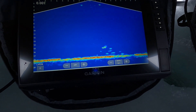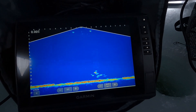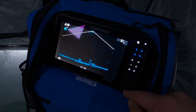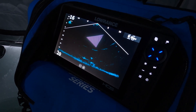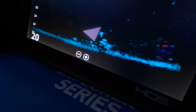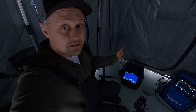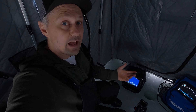You can still mark my lure and still see fish around it. Let's go over to the Lowrance now. On the Lowrance we don't have a gain setting — we have a contrast setting. Lowering that, we can still mark the lure and still see fish, but there are just a lot of trails behind those fish. It's not as sharp an image. I could play with the angle a bit. These two units — the Garmin and the Lowrance — are in my opinion the two best live sonars you can get today: the Active Target 2 and the LVS 34.